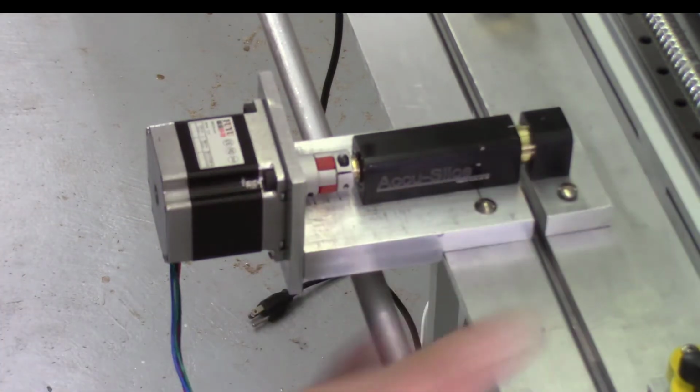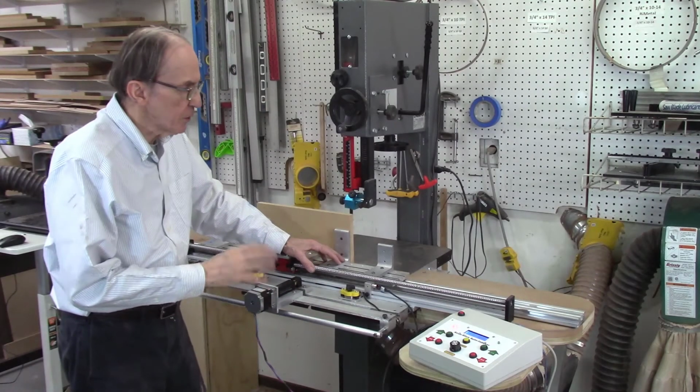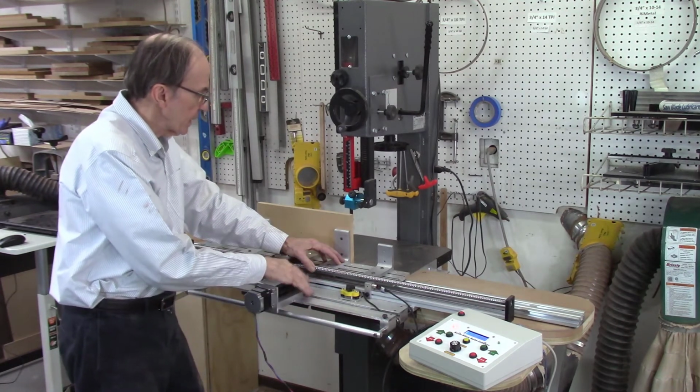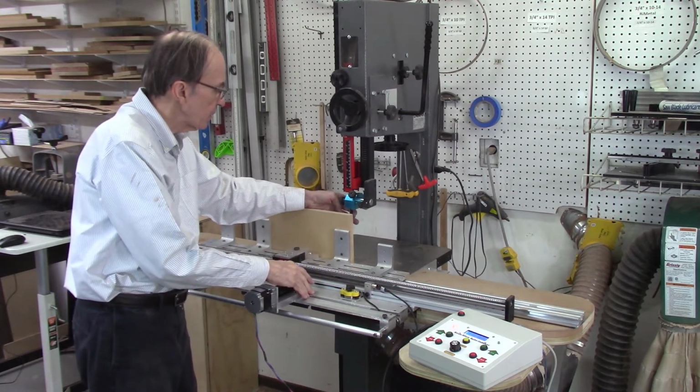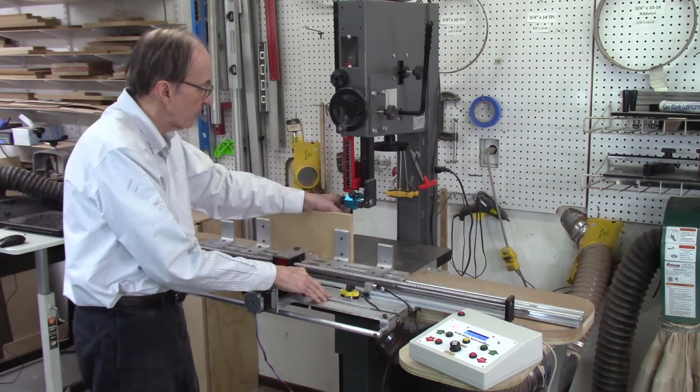And when you hear that cranking, that means it's reached the end point. I just shut down my bandsaw and retuned it because I was getting a lot of vibration in the table. And when I took it down, I noticed that the blade on both the top and bottom was not touching my back ceramic, or if you have bearings, same thing.